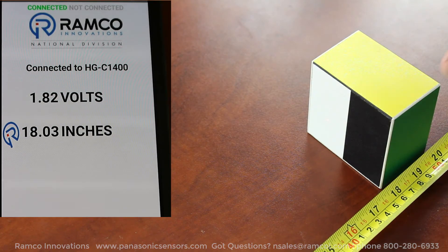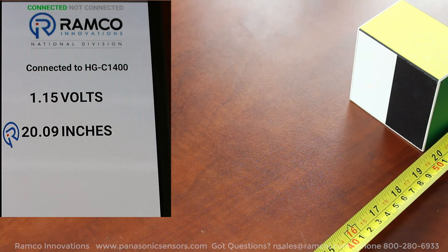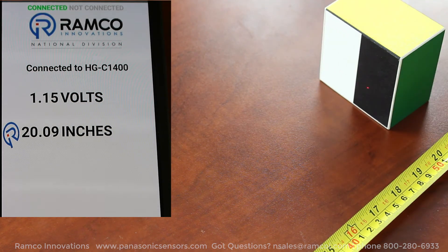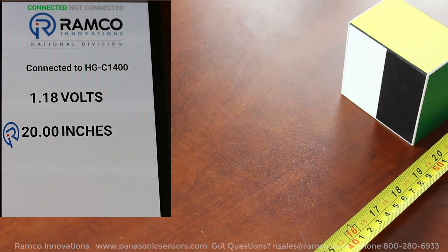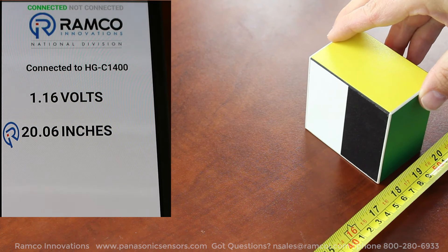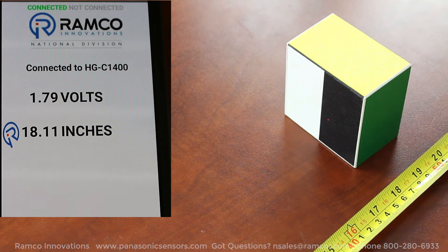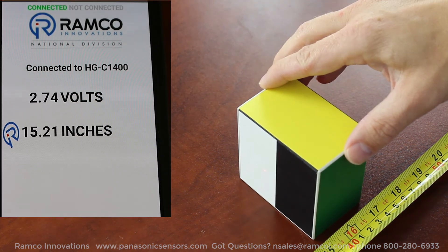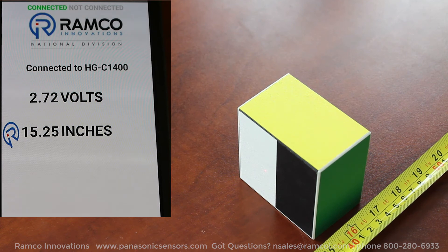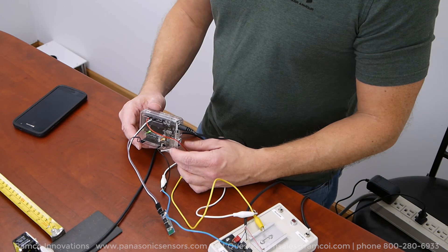As you can see, this Panasonic laser is really compact and has a great color response, meaning that it sees both reflective and non-reflective targets at the same distance. The accuracy and sensing distance of this particular model is really excellent, especially at a price point below $400. The application and connecting to the Arduino is really just for fun, but it is a really low-cost way to get data from the sensor. I can even do some really simple data logging, so it helps with testing out applications in our office.